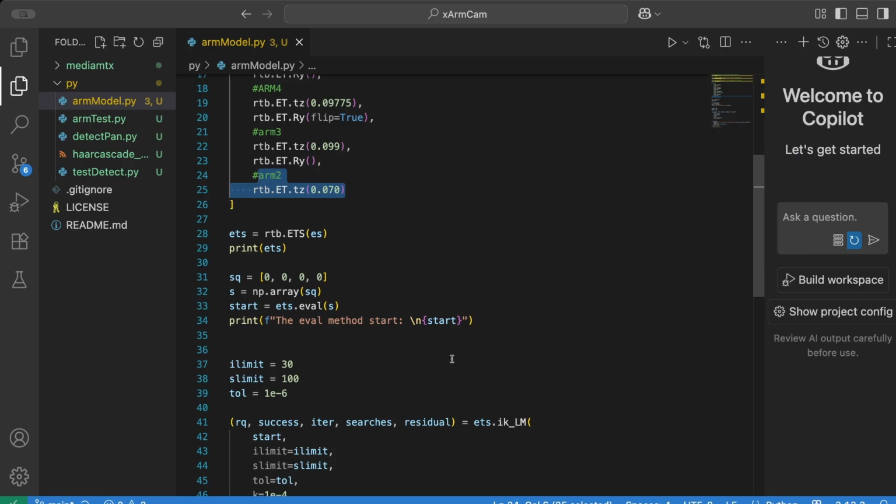Now we can go the other way, but the other way is kind of tricky. What we've done here is what is called forward kinematics. We've taken the angles of each of the actuators or servos, and we've calculated the end position of the robot chain. Great, fine. Going the other way, the problem is that when you've got more than 3 of these actuators, the number of answers you could come up with is potentially 0 or greater than 1. So we might find there's one position we could get to, we might find there's none, or we might find that we could do this in 2 positions.